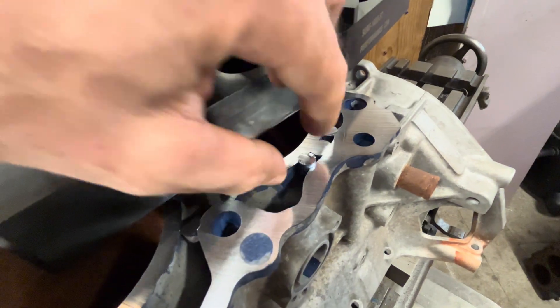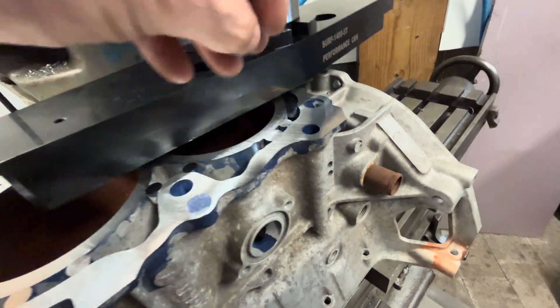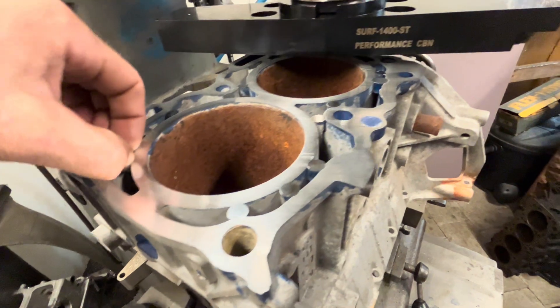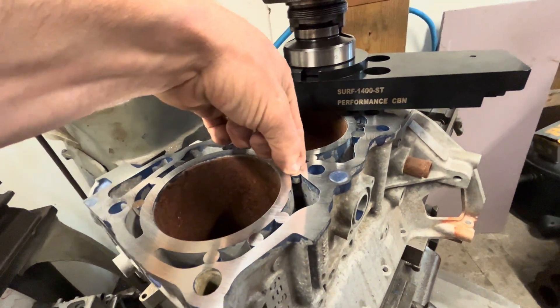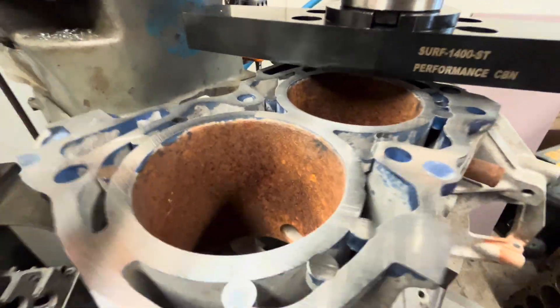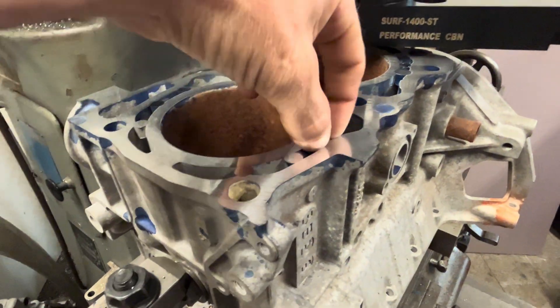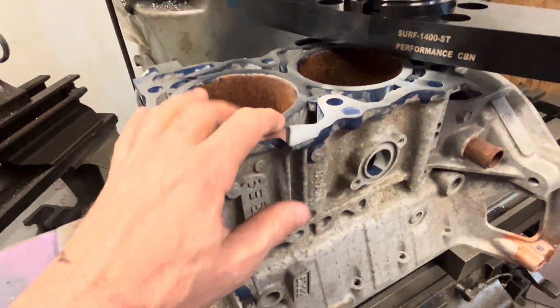Look what it did — that pin started moving. We've been hammering it so much. Let's pull this out. One of our pins — this pin I made out of stuff on the lathe. I'm thinking of tack welding them before I do this so something like that can't happen. But the question is: do we want to press this, barely press it, or use a non-interference fit and then tack weld? I don't know if I can tack weld in that corner — it could distort the block when it gets hot. Right now they seem to be good with just a half-thou press, and they really stick in there.